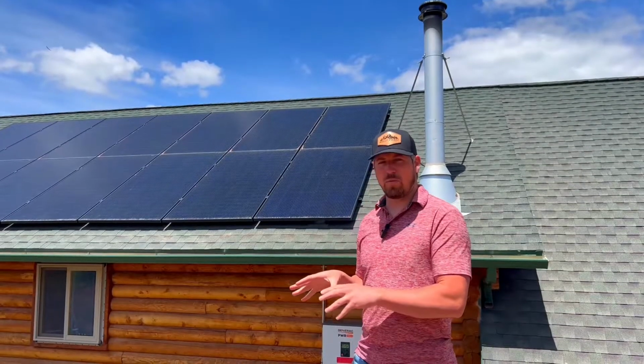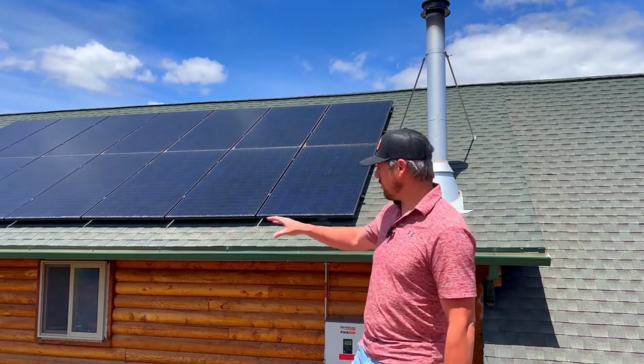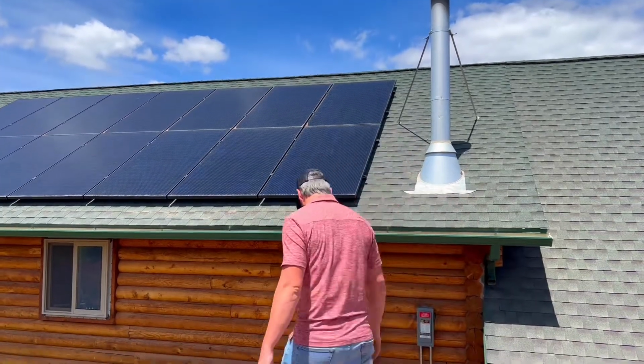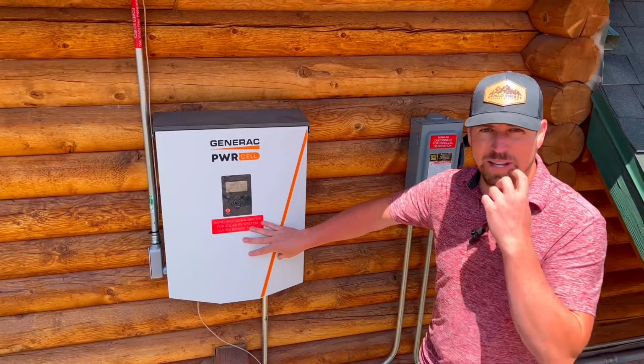So this client wants batteries and a generator in the future, but they didn't want to pay for it right now. So we built the system battery ready. We've got 5.5 kilowatts of solar on the roof, and then follow me down here. They do have the grid at this location. So this is a grid tied system as of right now.